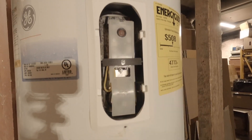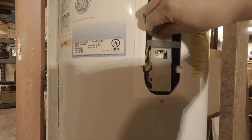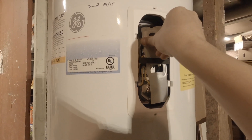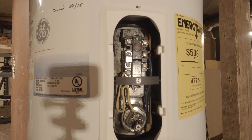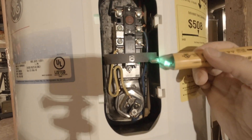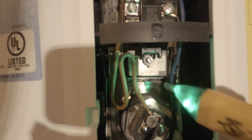Let's take this plastic cover off. Still not going to needlessly touch any wires here. All right, there we are. On top you can see the upper thermostat. It also has a breaker built in, and right there is where the adjustment screw is for the temperature of the water.